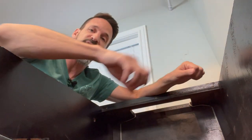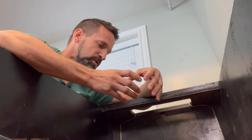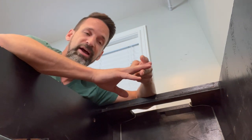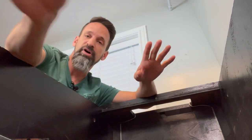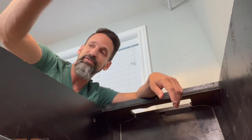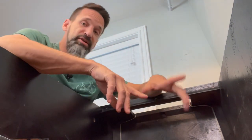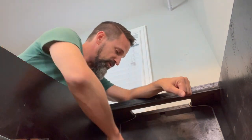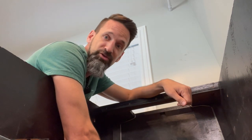If you need to control even more devices — because there are a lot of coils and switches — you'll probably need two or three node boards connected in different places on your play field. In my online tutorial we go through how the first node board can control eight high-power coils and 32 switches, which covers flippers, slingshots, ball trough, and lane guide switches. That uses up one board. Then you'll need additional node boards for the middle and upper third of the play field. You daisy-chain them with ethernet cables — first to second, second to third, last one back down to close the loop.